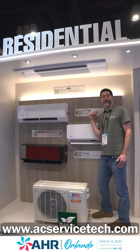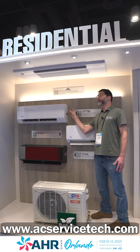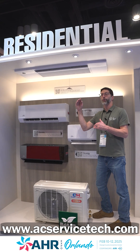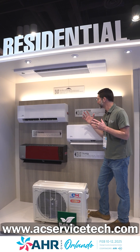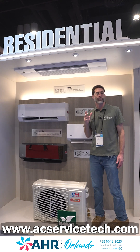The other thing is humidity. Humidity is a huge deal, and this is a very significant update for mini splits — to have a humidity sensor so that you can lower the humidity inside the building without lowering the temperature, which means you're not accidentally lowering the dew point. This is a pretty exciting feature to now have included in the Cooper & Hunter brand.